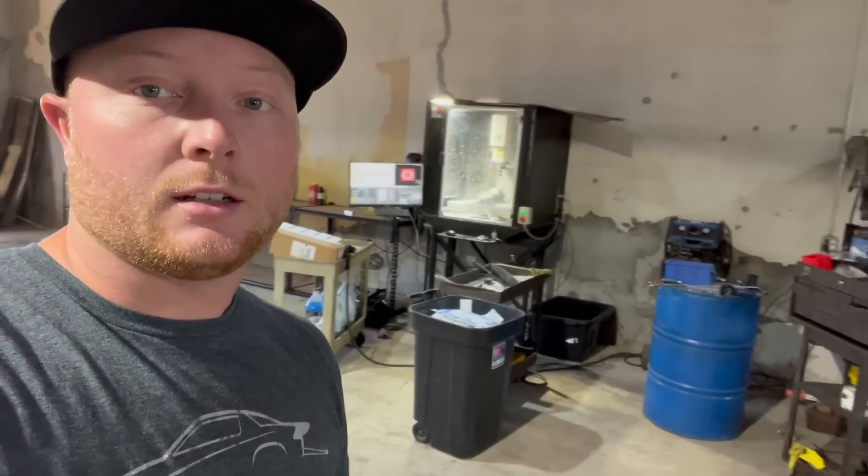We're going to set up basically a cooling system. You can buy one from Tormach but they're like $11,700 and I don't have that kind of money. So I've got a tote, I've got this pump sitting in the tote, I've got some clear PVC line that we're going to run from the tote up and over, and then I'm going to zip tie this thing basically as a spray nozzle and run a drain back to the tote.